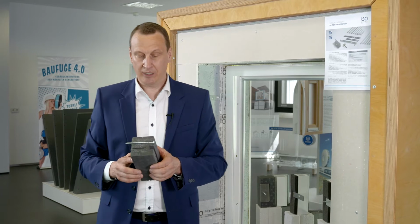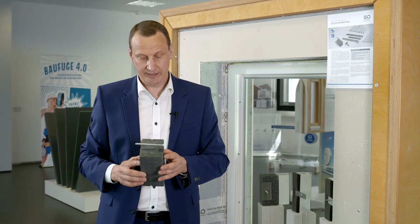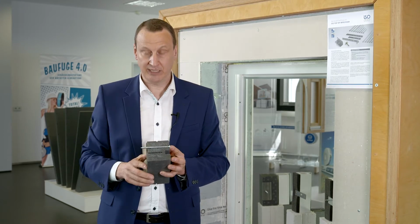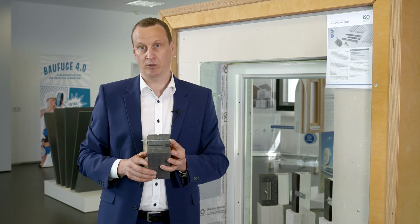And the screw with the flat head, i.e. the FK screw, we use this one for the WINFRAMER Type 3. Here we can see nicely that the head settles onto the surface and thus produces the contact pressure that I will need for bonding the WINFRAMER to the substrate.